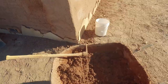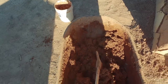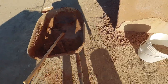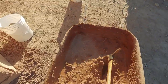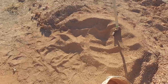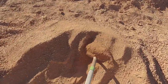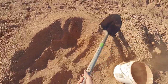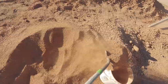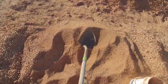There you have it — that's your pack out. When we go to put the scratch coat over this, it'll have something to hang onto. Now we're going to do some scratch coat. This stuff is a little bit too dry to trowel, so I'm going to add a little water. This material has only been sifted down to half an inch, which probably still has some rocks a little big for most scratch coats, but in my case I'm building the wall out thick enough that those stones aren't really going to get in the way too much.